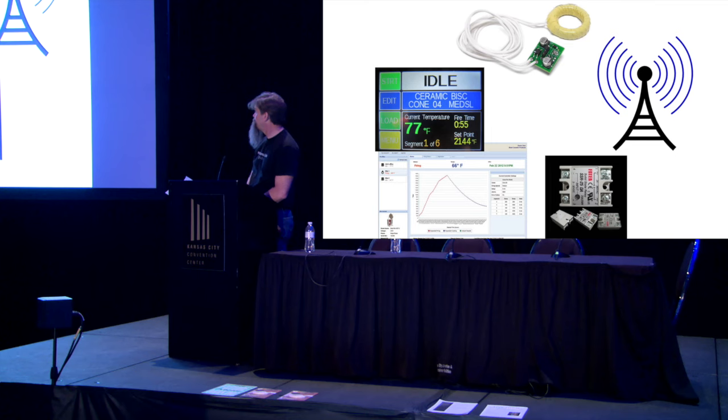And then up there, that's a touchscreen controller. These are coming. I know that this has launched. Bartlett is putting these out. There's another one out there called TAP, I think. These are making our interfaces easier, because the thing that scares people the most that I have found about computer controllers is they don't know how to talk to it. They have no idea what those four little symbols mean. 5, 3, G, 5. What does that mean? Well, it's actually segments. But unless you know that, you don't know that. These are much more intuitive because it's plain English. I can move things around. We live in a digital world where we use our cell phones and we're used to swiping and pinching, and so we're starting to make our interfaces react more to that.